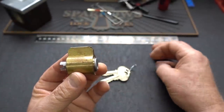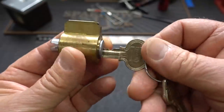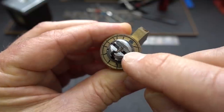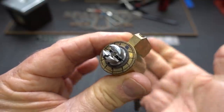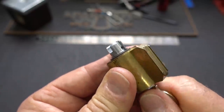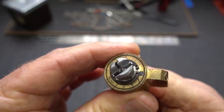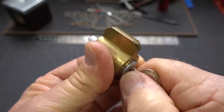For those of you guys who've never seen these before, we actually have two keys for this. So the first key — let's rotate it around the back and take a look. You'll notice we have a shear line there; I've drawn some lines on it. So if that happens to be the one that turns, you'll notice it. And then we have the inner core. The inner core is the one that, let's say this is on an apartment, so the apartment renter might get to operate that.